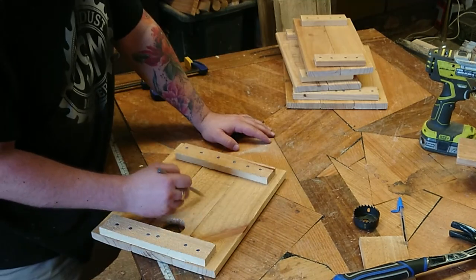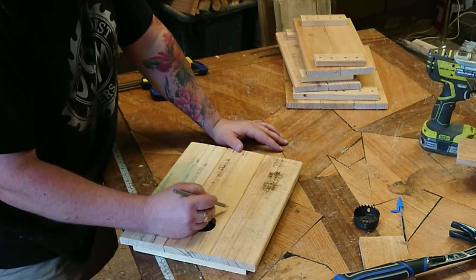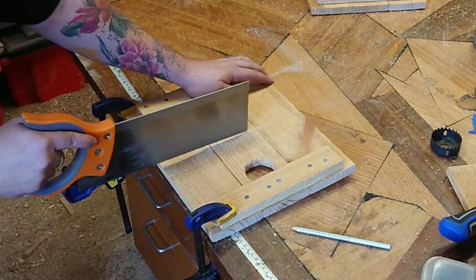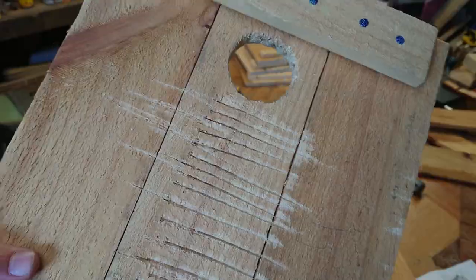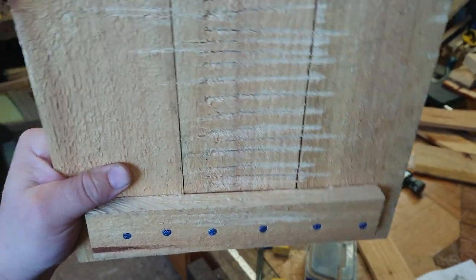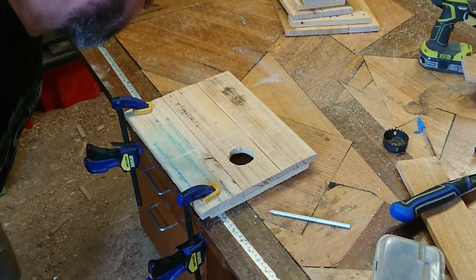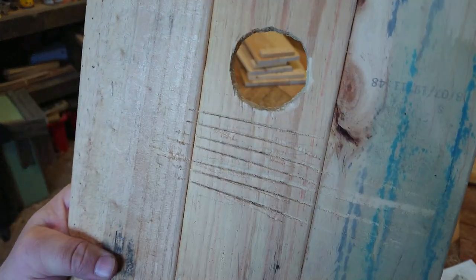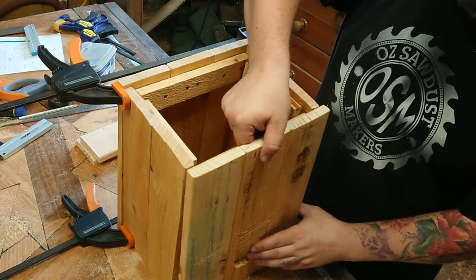I'm marking out some climbing grooves. These climbing grooves are essential — not only do they let some birds get in, but they make sure that young birds can actually climb up and get out of the hole when ready to start flying. Use the handsaw. They're rough and ready but they will work. Now there are a number of ways to cut those grooves that can be done much neater than that, but this is about doing it with the most basic of tools.